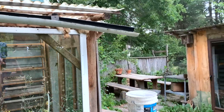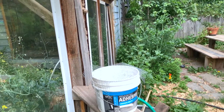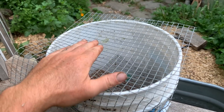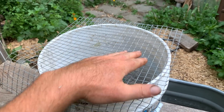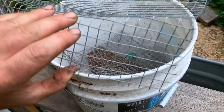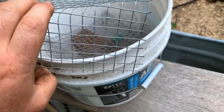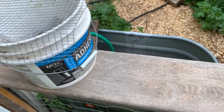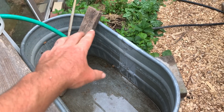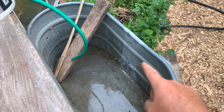Again, super low-tech and really simple. The last hurrah just dumps out in a free fall down, and now it goes into a washed-out bucket that has half-inch mesh on the top — so this would be our pre-filter for material. Easy to get that off, take this off and knock it. There's one below that's folded over a few times with a brick to keep it up, and then a little scrap of salvaged hose into a metal tank. We always put logs and material in there in case an animal or a bird falls in.